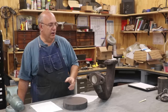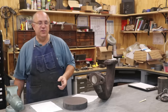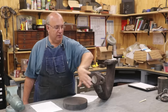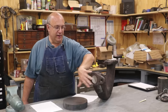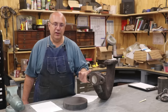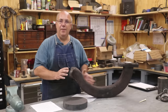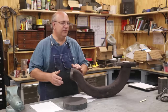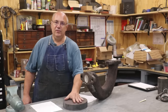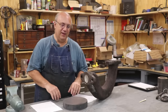Number two, from a machining standpoint, we were going to have to come in here, weld the ears on, and braze up the bottom that had been ground down to get the geometry and shape right. Getting the brazing and welding done was going to be the easy part — the hard part was the machining. It was going to take a really complicated setup. This steam pipe is not something that's easy to hold on a machine; it would require building fixtures. Going with this route, I can do all my machining on the flange and not have to worry about complicated work-holding. It's just going to make life much easier.